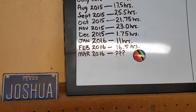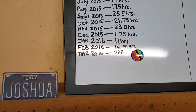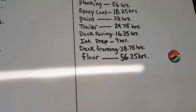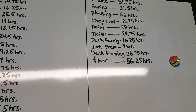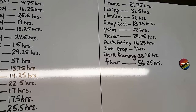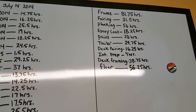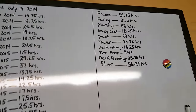It's officially March 1st, 2016. For the month of February 2016 we put in 16 and a half hours — all on the floor. That brings us to 56 and a quarter hours into the floor, and it's officially done. All the cut, fab, fit, and bracing work is complete. Keep in mind, sometime in the next couple of months I'm going to have to pull all the floor planking out and encapsulate it in epoxy for protection, then probably a couple coats of varnish to protect the epoxy from UV.